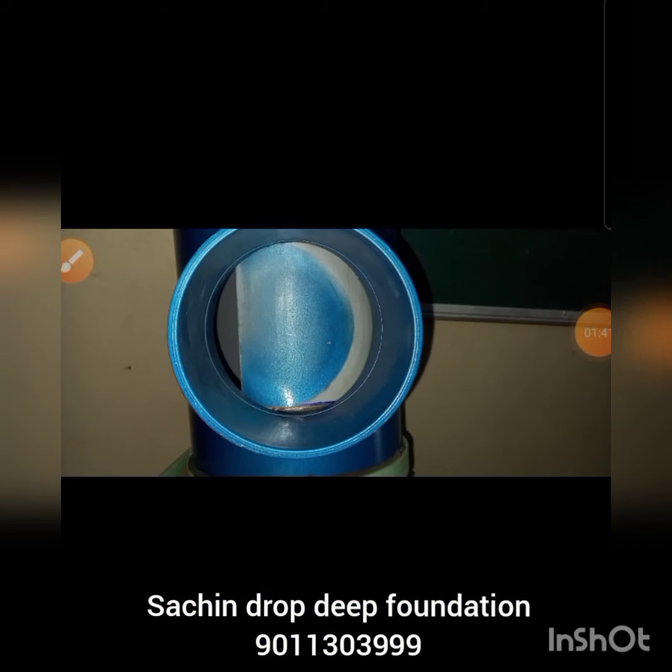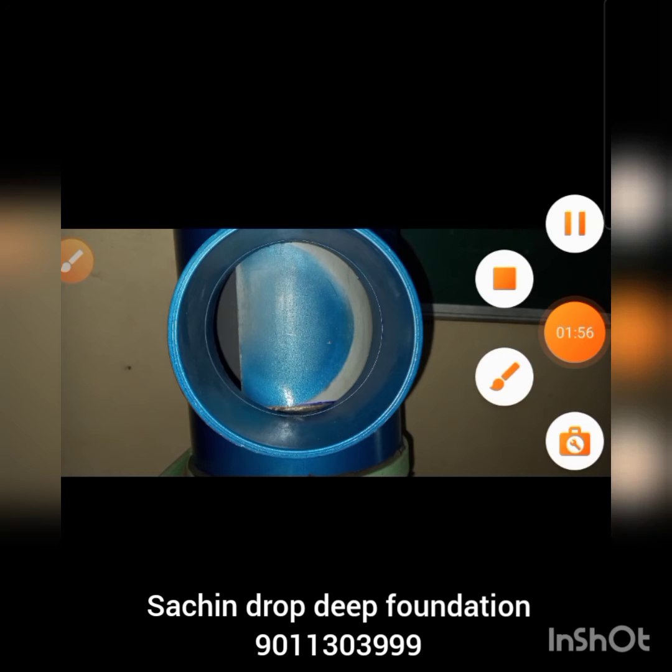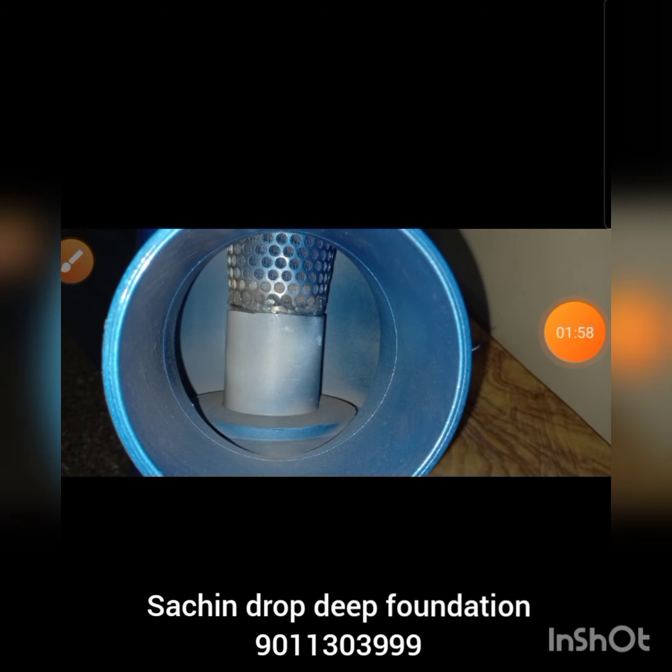At the inlet of the filter, almost 70 to 80 percent is blocked, so only 15 to 20 percent is open. This opening makes the rainwater flow tangentially inside the housing. The outlet of the filter should be firmly fixed at the bottom bushing, and the filtered water collected through this outlet is channelized to recharge through the recharge pit.